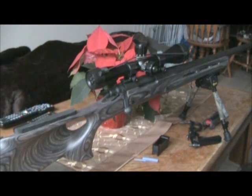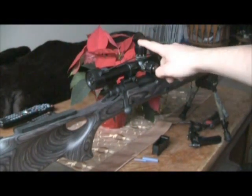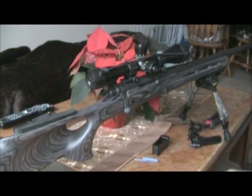Alright. So this is the final part of the video. I've gone through all the cleanup and trimmed all the excess epoxy compounds, so it should be good to go. I've gone ahead and mounted a Bushnell Elite 3200 scope on there. As per usual, I've bedded the rings on there, so it's a stress-free fit. I've also leveled the crosshairs off the base of the recoil lug. But if you want to see how all that's done, you can check some of my previous videos.